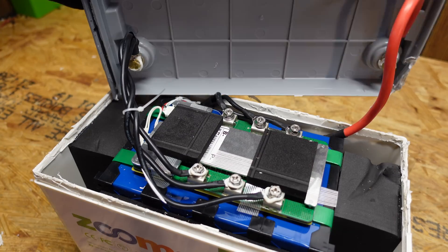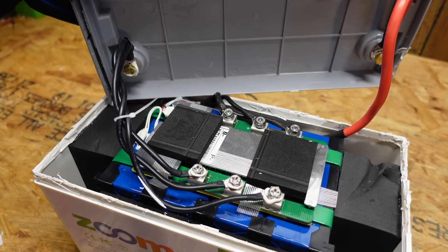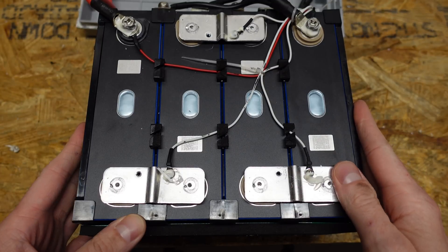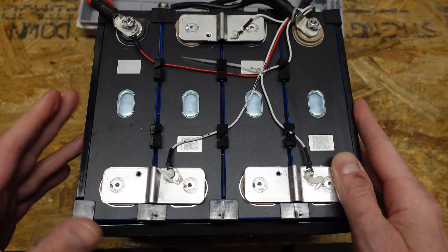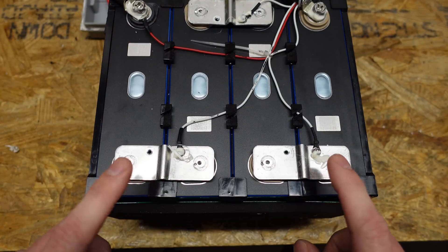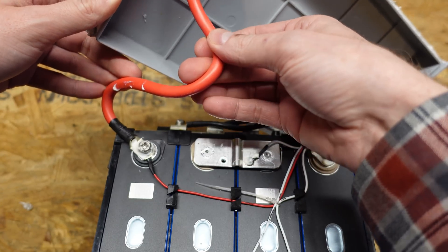This looks very different inside, so I'm glad to see that — I was afraid it was going to be an exact copy of what I had just reviewed. This battery pack is comprised of four GFB brand 100 amp hour cells, the same exact cells used in the SOK batteries. The cells are laser welded together at the series connections using pure aluminum strip. The main positive is a 6 gauge silicone insulated wire with a 200°C insulation rating.